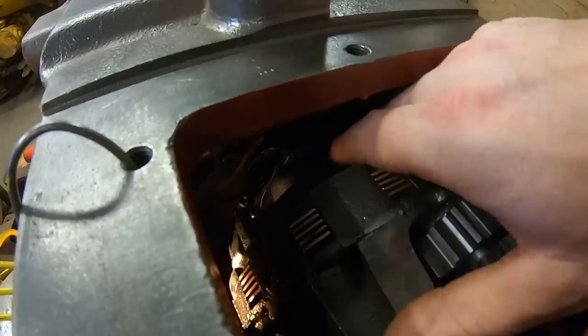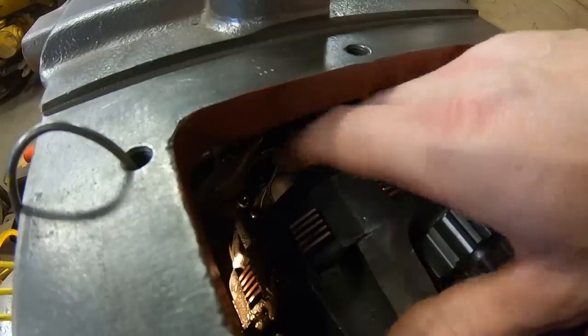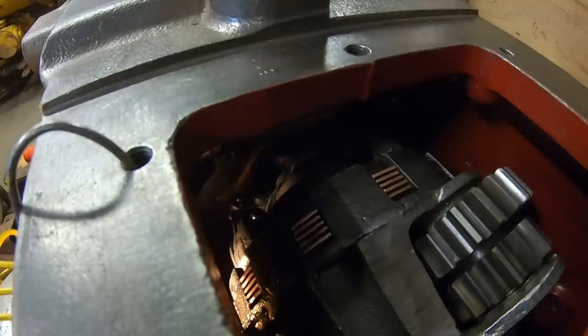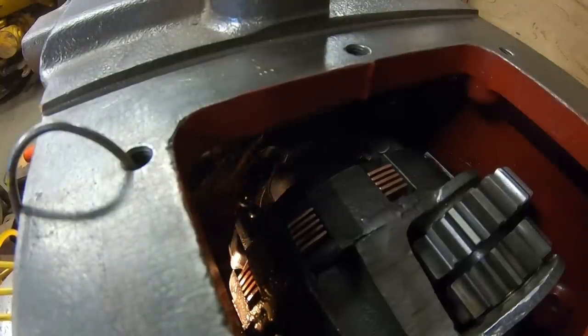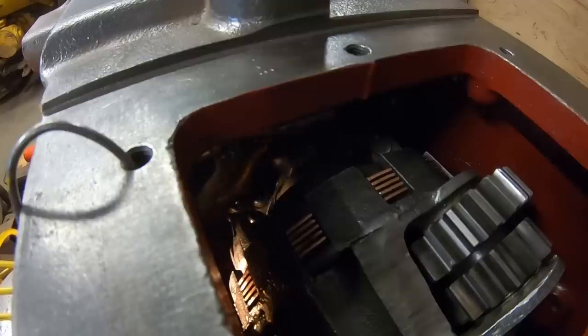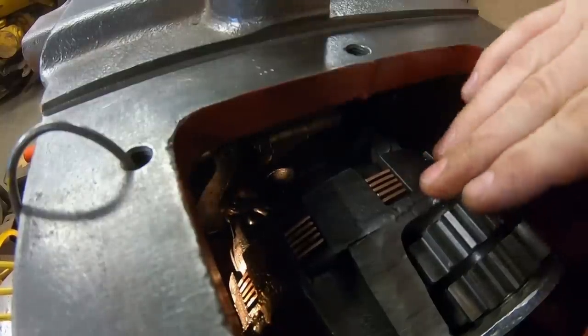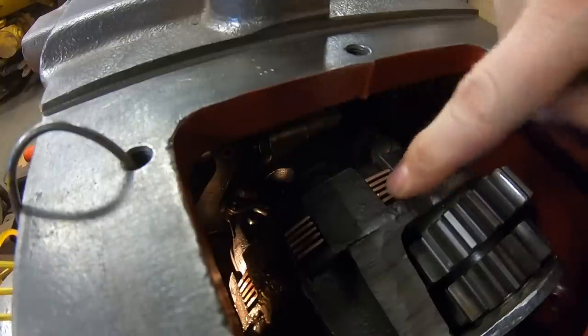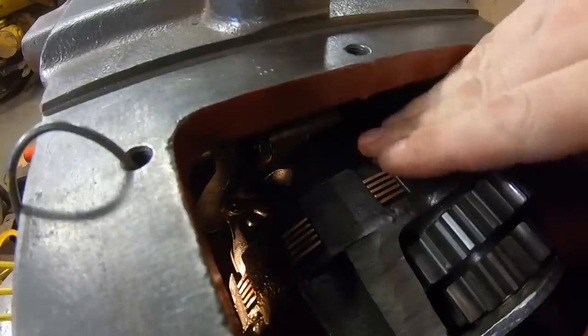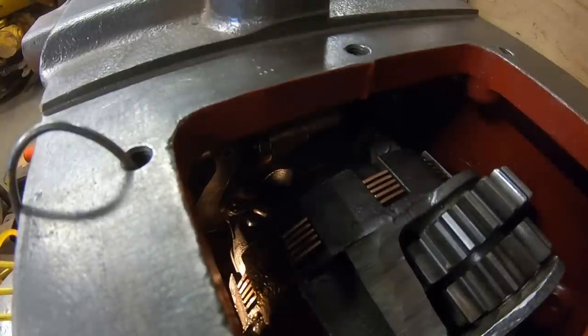Taking this opportunity to do the final adjustments on the over-center clutch for the Amplitor. I've got a good snap on it now. You want to keep this clutch pack adjusted up plenty tight because when you're in high range, your power flow is all going through that — you don't want it to be slipping at all. Through the top here is the easy way to do it. Now I'll show you the hard way.